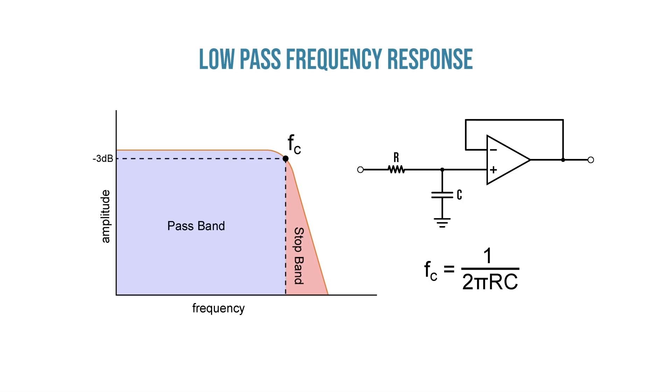I need to connect a potentiometer to vary the output voltage, but any impedance or reactive components placed on the output of this RC circuit are going to change the cutoff frequency, and we don't want that. So I'm going to use an LM324 in a non-inverting buffer configuration to isolate any impedances, so that as I turn a volume control, it's not going to change F sub C or the cutoff frequency.